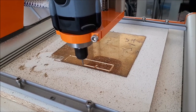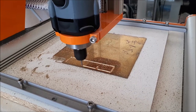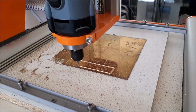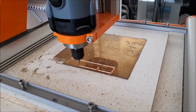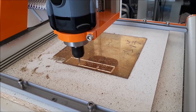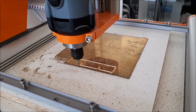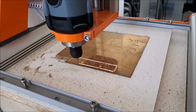because I wanted the wheel sets removable in case I needed to change the gauge in the future, possibly. I didn't want to solder the bearings in place. The normal top hat bearings, which we'll see in a minute, were convenient, and so I slotted the frames down from the bearing holes in this initial frame cutting process that you're watching. But I then needed to alter the bearings in order to stop them from rotating.